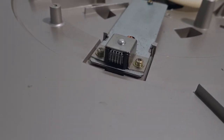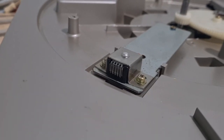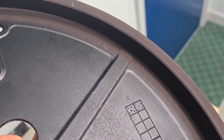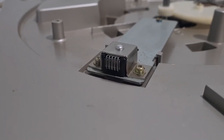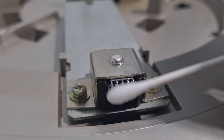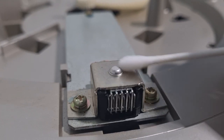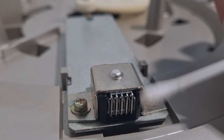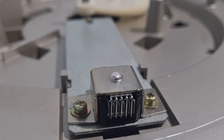One special thing to mention: this turntable has underneath the platter essentially a magnetic head, almost like a tape head, and it measures the speed through this because the inside of the platter is magnetised. If we have a look inside the platter, you can see the ferrous coating - the difference in colour on the outside - and that's what the head is picking up. So before we put this back on, same as you would any cassette head, I'm going to give that a little IPA clean. Just a very gentle clean - there's nothing on it really but why not. This allows it to know what speed it's doing at all times.